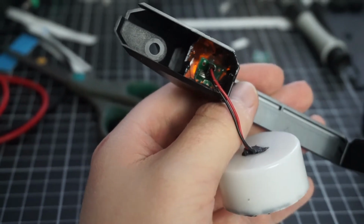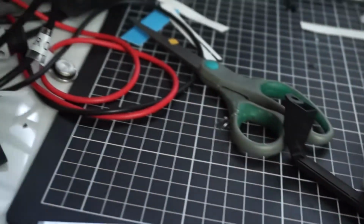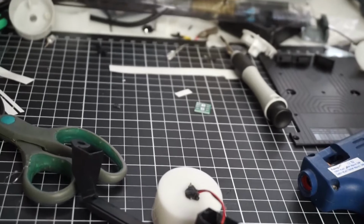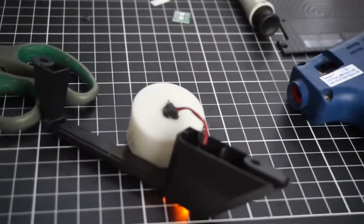I'm going to put a resistor on. I'm just going to run it off probably just 5 volts for now. Just tack it off somewhere on the power supply. I'll probably use JST connectors and a female 4-pin inline Molex connector for that one. And then, yeah, it should look pretty neat.